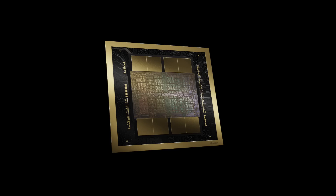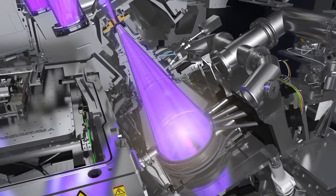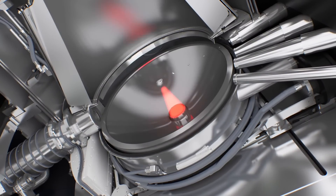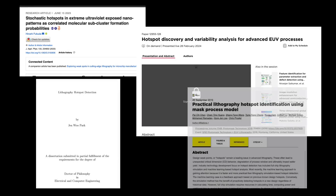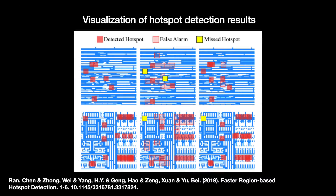The trend of using AI and parallelism in lithography will only strengthen. TSMC also has a dire need for more accurate computational lithography models to predict hotspots — certain areas in a design more susceptible to open or short circuits. Hotspot detection will become even more desirable in the High NA EUV era because of stochastic issues and the machine's high cost of ownership. Traditional pattern matching methods miss new types of hotspots, and machine learning methods produce too many false positives. The search continues.